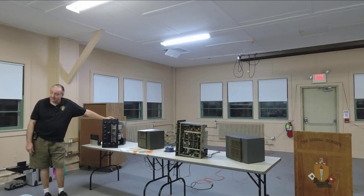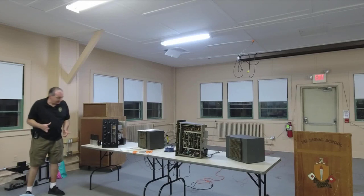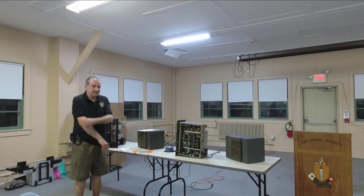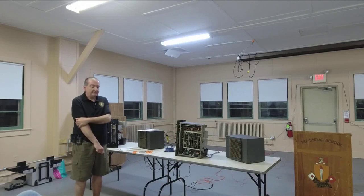Hey, Johnson, the amazing crystal, what is that all about? Basically, you tune the crystal filter to separate stations. The normal IF filters are LC tuned circuits. Now you come in there with a crystal, which has very high Q, and it gives you one filter stage that's extremely sharp. Then on CW, Morse code, with the BFO on, you hear a signal here, and you can also hear a signal 1,000 cycles on the other side. The crystal filter is sharp enough that you can not hear the other side of zero beat.